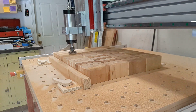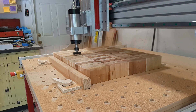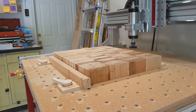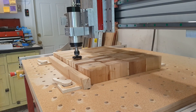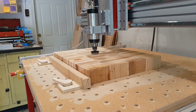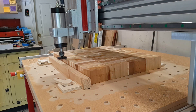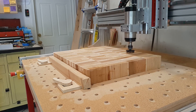I think it's related to spindle power. This spindle is rated at 2.2 kilowatts — maybe 3 horsepower? I've used a handheld router that was 3 horsepower and that thing is a beast, so my gut is this is actually a little bit less than 3 horsepower. Anyway, here's the E-stop: motion stopped and the spindle just rolled to a stop. No harm no foul — I restarted the machine in Mach 4 and took a much lighter pass. That burn mark is taken off on the next pass, just a gentle reminder to take it a little more easy.